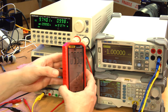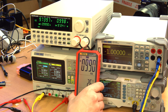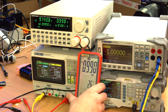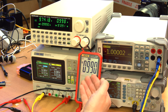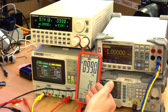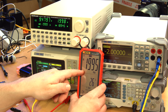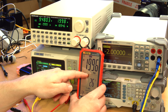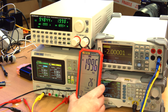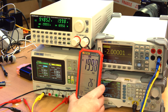It's showing red again. I don't know why the screen is showing red. I'm only doing this test at 10 volts, so maybe it considers that to be a high amperage. It has a 10 amp for 10 second max limit, so we should be nowhere near that at 1 amp. So I don't know why it'd be getting upset with me. Okay, and here we go at 2 amps, and it's actually 1.995 amps. And it's displaying in milliamps, even still, rather than amps, which seems weird, but that's fine. Oh, there we go. 1.997 amps.